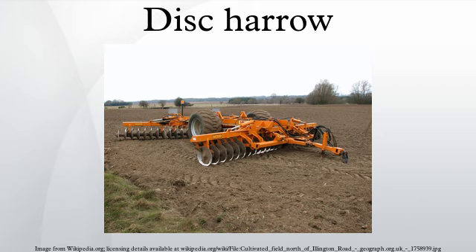The heavy-duty offset disc harrow with large diameter disc blades of 26, 28, 30, 32, 36, and 40 inches, and with increased disc spacings of 10, 14, and 18 inches, are the primary tillage tools used to break virgin ground, to incorporate residue into the soil in preparation for a ripper/subsoiler, and to break up compacted soil in order to increase soil aeration and to promote soil permeability in lower levels of the soil profile.